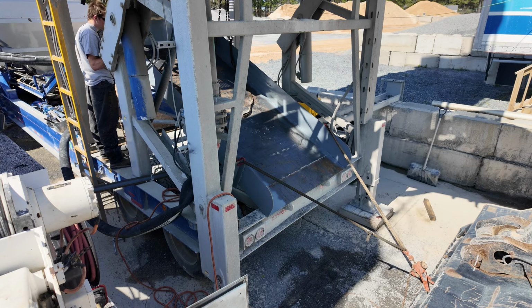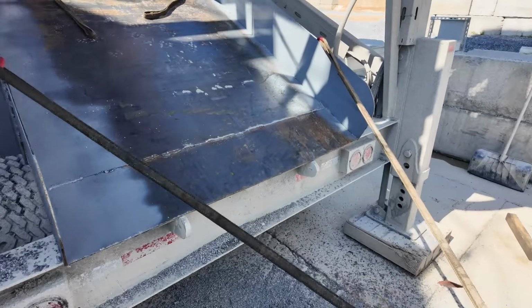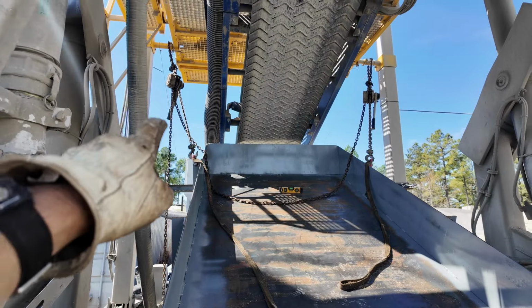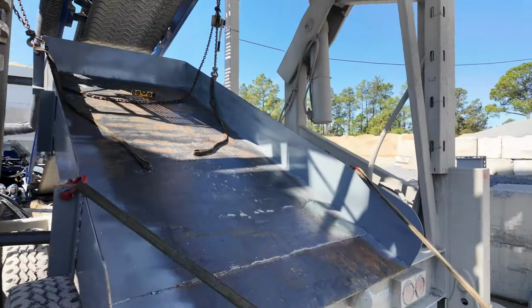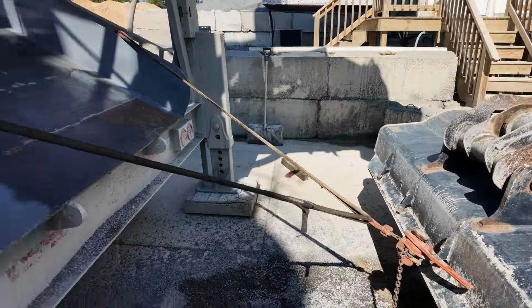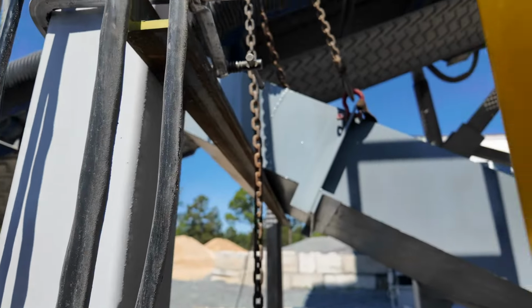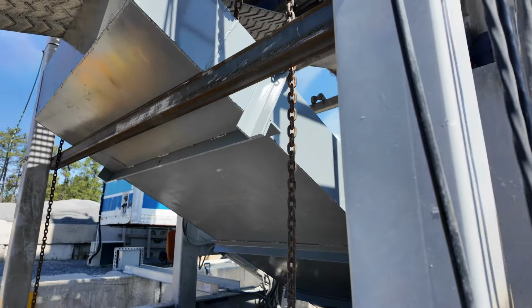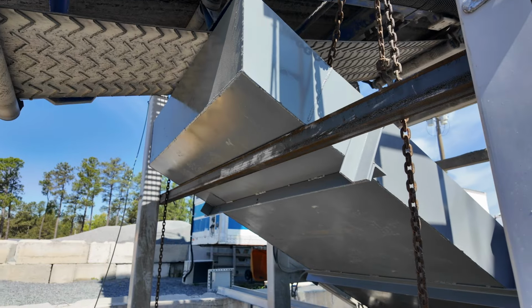Grab that angle iron and your clamp. A little bit of the rigging here. So, got two come-alongs up there holding that in. And this one tying this end down here to the loader. Now John's getting ready to burn in this angle iron underneath. That's gonna hold it up. We got one there, and then one on the bottom that's gonna go in, and then we'll tack it to that thing, and she should be there.